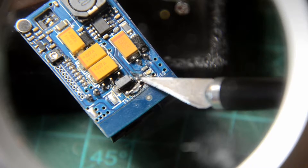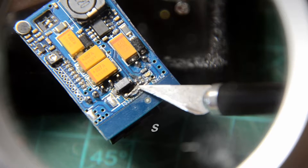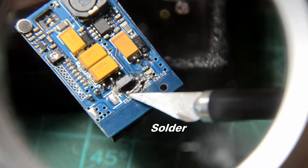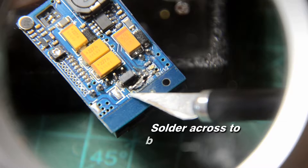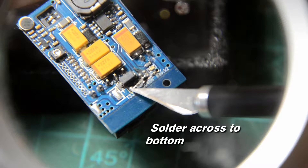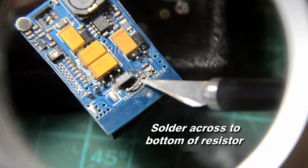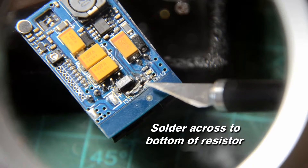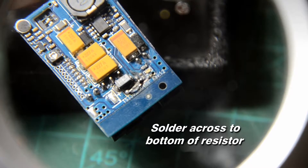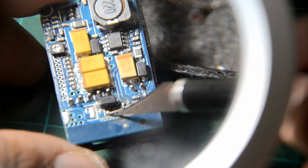I think that's a resistor. You have your LED right here and this little tiny part — that little pad attaches to one side of the part that got blown. So if you wire a tiny wire from this point — and if you still have that pad, it typically remains intact — you can solder to that point and then take that wire and solder it to this little component at the very bottom. That basically restores the unit back to working condition.